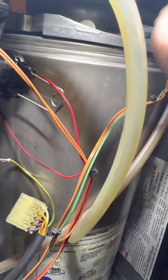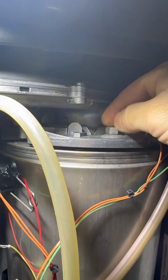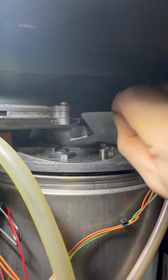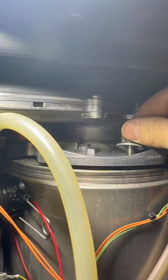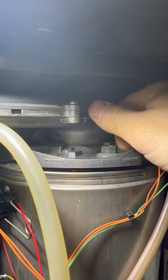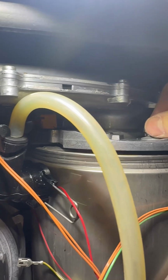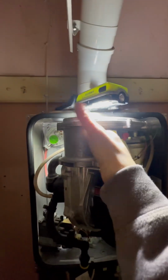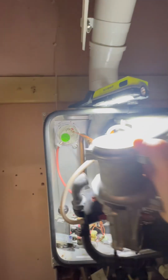Anyway, back to business. 13mm ratchet spanner on the top to undo the nut. This is another one of my top tips. Remove the nut, then remove the securing plate, then put the nut back on. Only needs to be tightened finger tight really. This just makes it easier for you to spin the fan assembly out. Here we can see I'm doing it one-handed. Needs a bit of a wiggle, but it comes out.